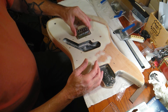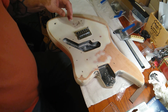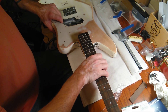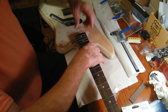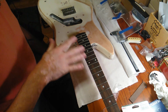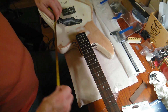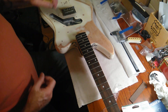That bridge is going to be mounted somewhere in that area — I measured it to get it pretty close. Let's set this neck up here just for reference. We'll get that neck pocket straight and it's going to be pretty good — it should work, it shouldn't be any problem. And right about there is just about where it needs to be for a 25 and a half inch scale, like a Fender.